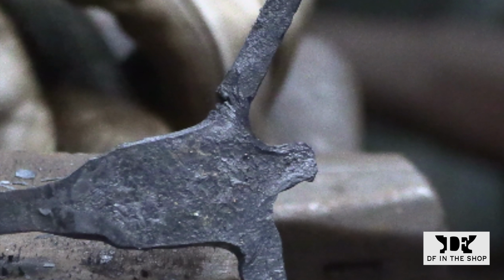And you will notice in this video that this problem seems to appear and disappear in different clips, because some of the better clips that I had to use were from forks that didn't make it through the process. So to avoid this problem, hammer one side at a time and leave the tines in a V shape, and you'll see how that'll simplify things in a minute when I saw out the tenon.